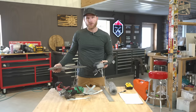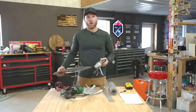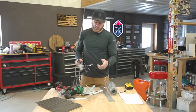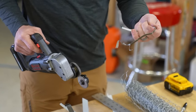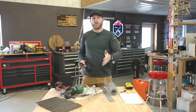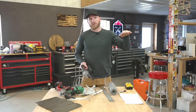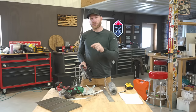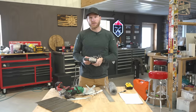The last thing I want to test is panelized steel - the steel you see on roofs and side walls. If this is good for cutting angles on gable ends or side steel instead of a nibbler, which is slow but does a great job, this might make it onto the trailer. I just discovered the reverse button too - I got stuck and hit reverse, pulled it right out. That's actually a useful feature.